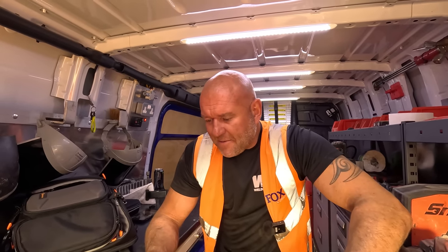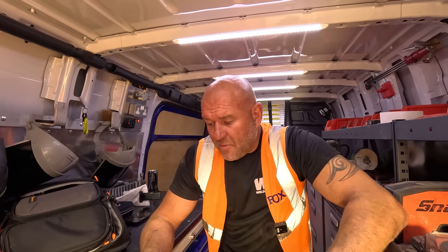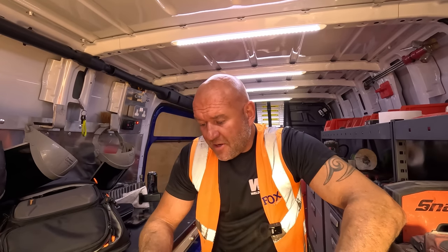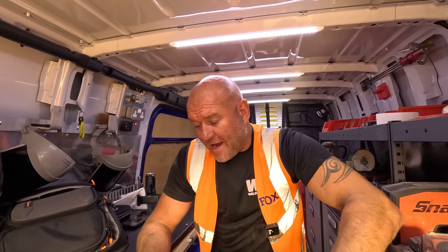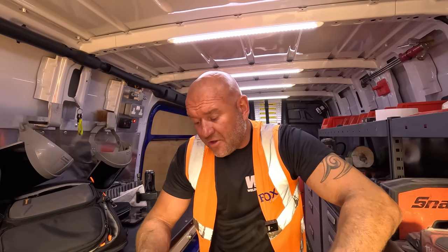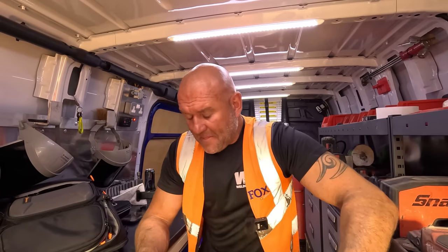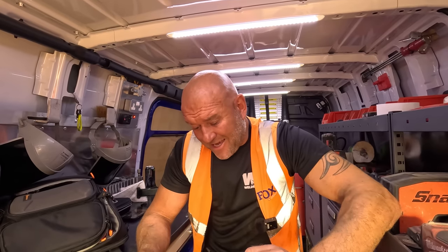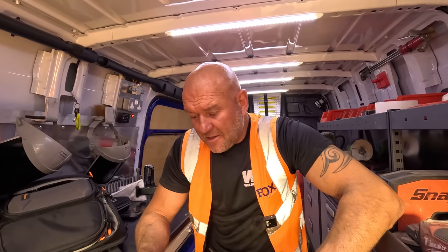Another comment. Madman Marine. Well, this man's talking about the moldboard we did. Can I ask, is there a particular reason you don't use a plasma cutter on a track rig? Maybe it's different where I am, but oxyacetylene is expensive and air is free. So I always find it much cheaper to use the plasma cutter rather than the torch. Well, I use oxypropane, I never use acetylene. I don't have a track for the plasma, and the gas cutter on the track is perfect, so there's no point me changing it over, you know what I mean? We don't do that much track cutting anyway.